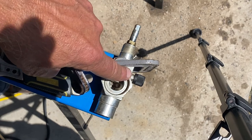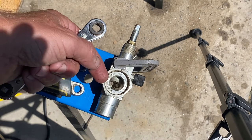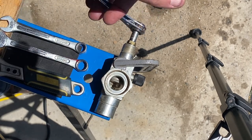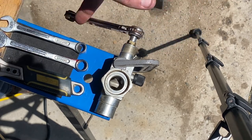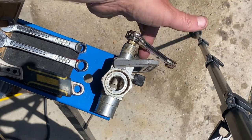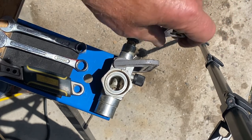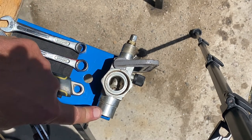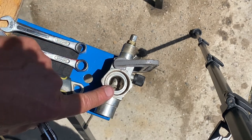If I need to isolate whatever this is connected to — whether it's a compressor — I will turn it all the way around. You can actually see that plunger moving down until it gets to the bottom, which is called front-seated. Now whatever is connected to this port and whatever is connected to this port can no longer communicate with each other — there is no flow between these two.